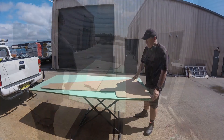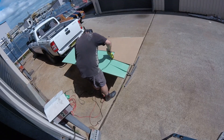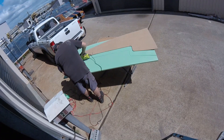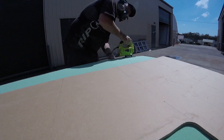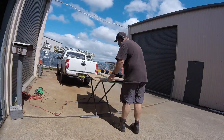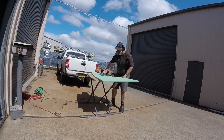It appears that the rest of my life is going to be spent taking the templates I've already derived from the plans and the hull shape from my chain jig, then scribing them onto the H80 foam and cutting them out. I did actually work out at a later date that I was better off laminating a complete 2.1 by 1.2 metre sheet of foam and then using the excess for smaller structures.